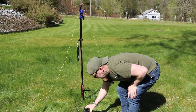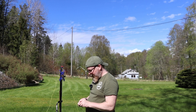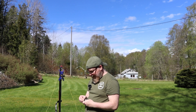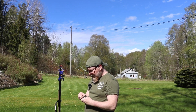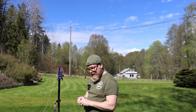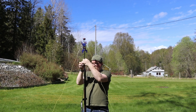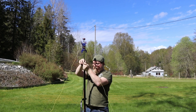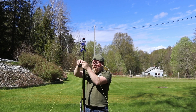The next smart tip is to use some electrical tape to tape the coax to the mast. That prevents a lot of drag and bending of the mast. There's still going to be some bending, but a lot less once you have the weight of the coax pulling down on the mast rather than sideways. Start taping relatively high up, and just do a couple of loops — probably one is more than enough.